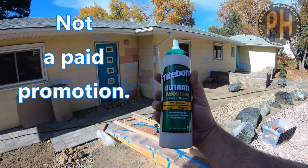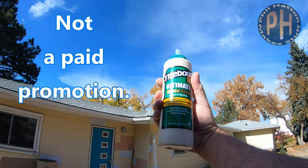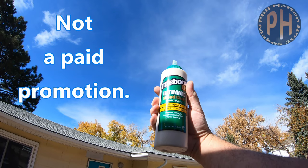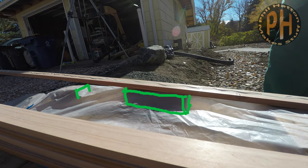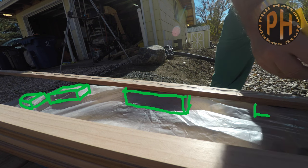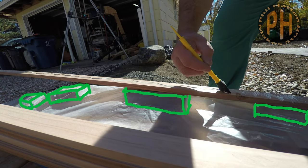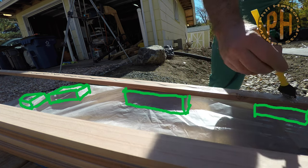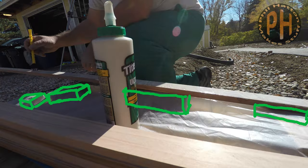I glued the strips together with Titebond 3 because it should work well out in the weather. If you're wondering why I added the blocks, the handrails should extend past the bridge a little on either end, so I needed the room to clear the sidewalk when I clamped the handrails to the bridge, and I also wanted the handrails to have a slightly larger curve visually.